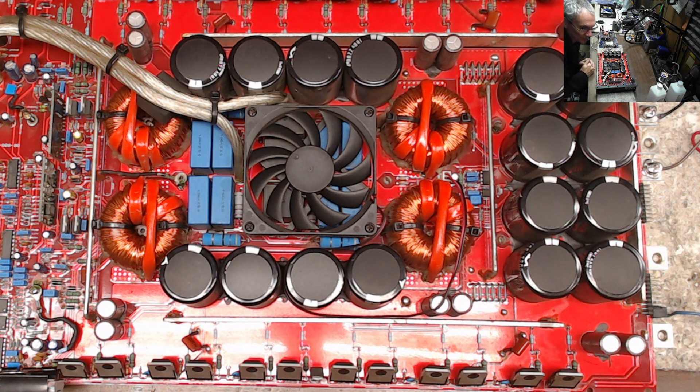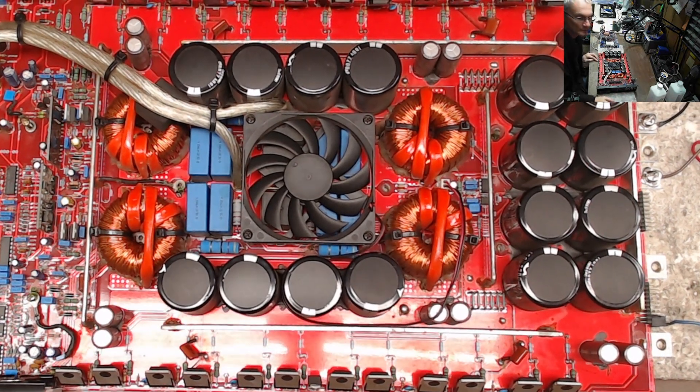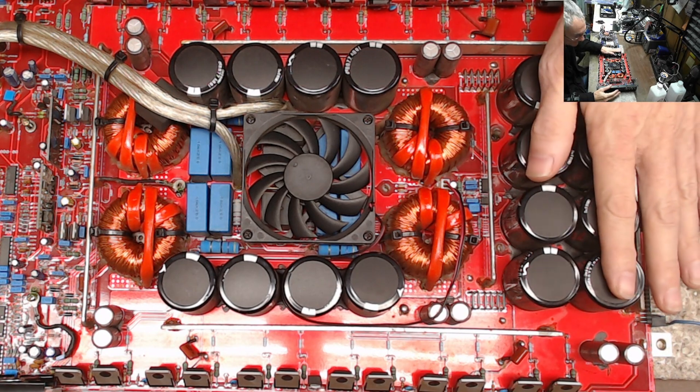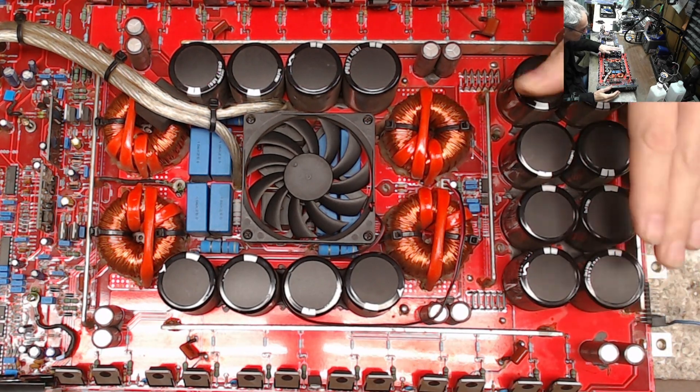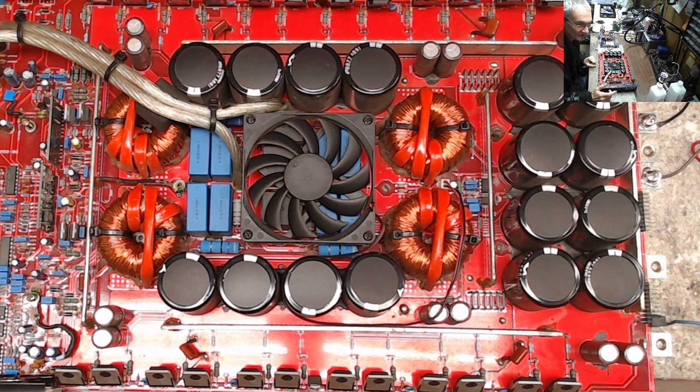This is why I like to test these boards before hooking them up to full rail voltage — there are many different components on these boards that can fail, depending on how thorough your rebuild is. So the way to fire these up, you need your appropriate voltages and your reference voltages, just to power up the system. Then you have to find a way to check the switching signal.